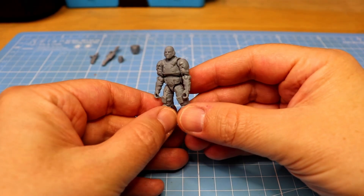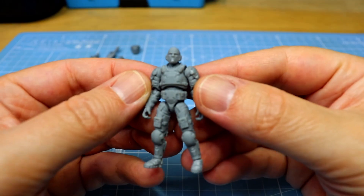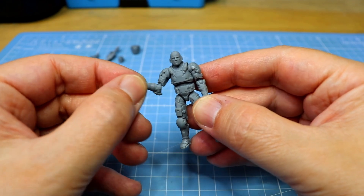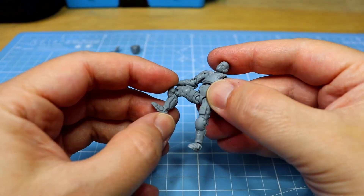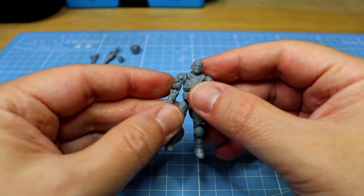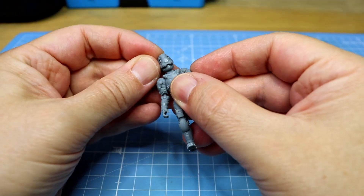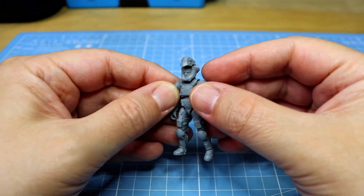The action figure — the hawk I usually use for test printing — I printed this figure roughly five months ago. It came out pretty nice as you can see. This five-month-old figure actually still works pretty well. It didn't loosen up too much; the joints still have good grip, it's very tight. That means there's not much deformation going on, even with the pressure on the walls of these snap-fit joints — that's a very good sign for this resin. The parts fit quite well, there's a pretty good helmet fit, and the helmet visor hinge still works fine.